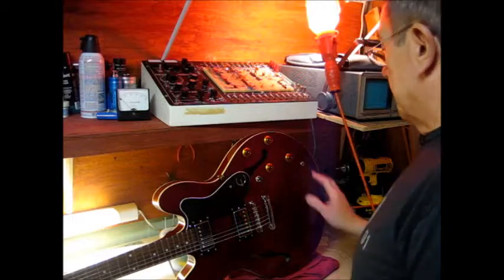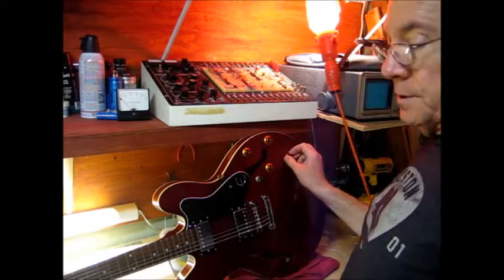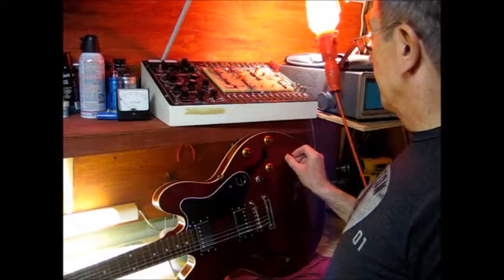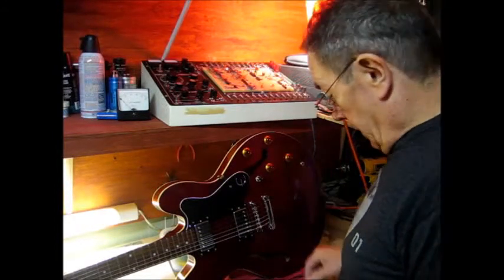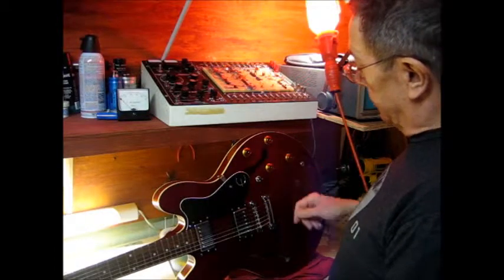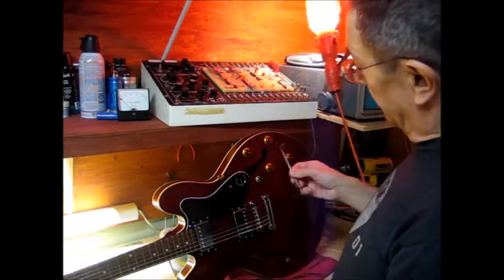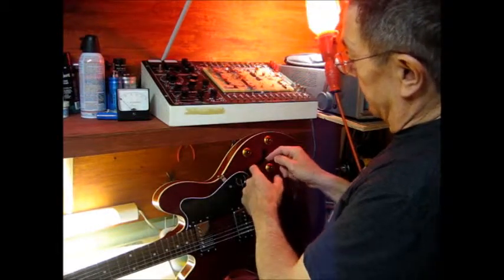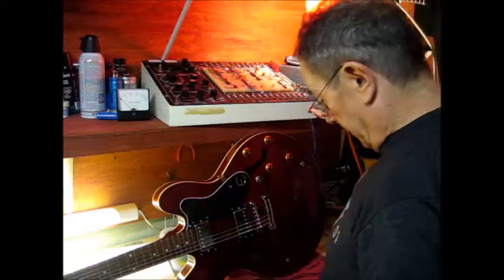Okay, so I just determined that the scratchiness didn't go away on this tone control. I'm going to have to remove it and replace it. The knob off the nut, drop it down through, fish it through with the dental pick, get it over here and see if I can desolder it and remove it through this F-hole.